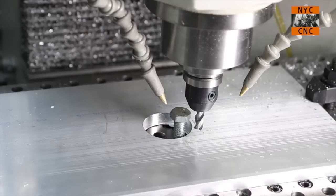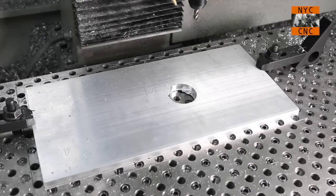So with that, I've got my new program up here. I switched up the order. We're going to do the little machining first with the holes, the drilling, and those little 3/16 slots, and then we will come back and do the roughing waterline, which is the majority of the machining operation. Okay, I've got the first tool in there to spot our drill holes. Let's rock and roll.